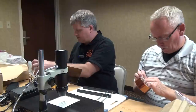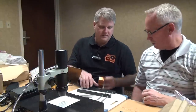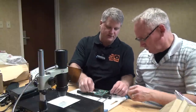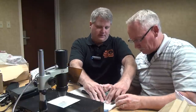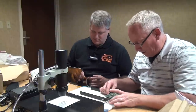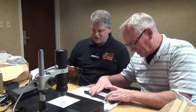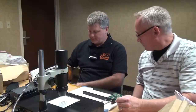The next thing is we're going to use the polyimide tape, and the polyimide tape is going to protect the area that we're dealing with. I have some tweezers and a razor blade for us to cut the polyimide tape. This is called Kapton polyimide tape — K-A-P-T-O-N. You can buy this from China for rolls and rolls of it for about $5 or $6 each. Same stuff Apple uses on their motherboards.